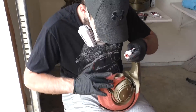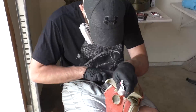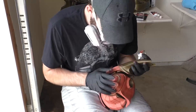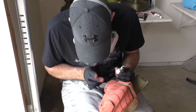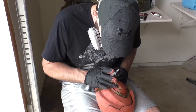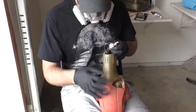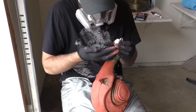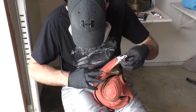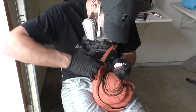That's kind of a recurring theme with this build — with a lot of finishing 3D prints, you need to find a good well-ventilated area so the chemicals don't bug you. I used to do this stuff in a one-bedroom apartment and it did not go well. Here I'm working outside in my garage with the door open. We're going to let the Bondo cure for about six hours until it's fully hardened.